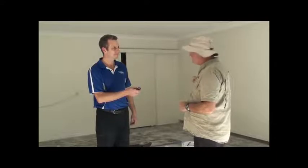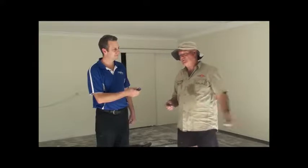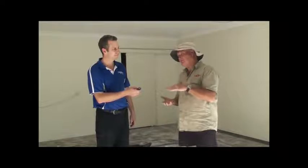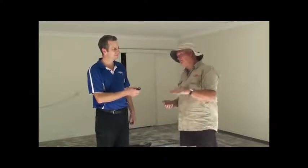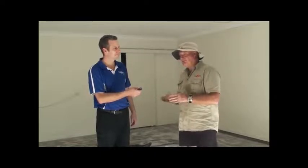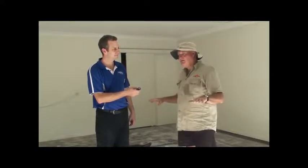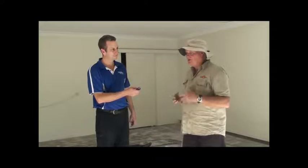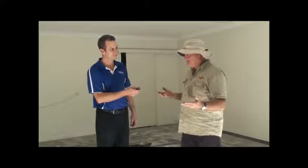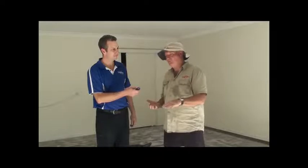The other thing that I'm watching out for is once I've cut around the outside, the exterior perimeter of the garage is where it tends to bleed in, and if you don't put enough on, it becomes dry and the flake won't stick. So the whole key of what we're trying to do here is to get an even coat of epoxy across the whole floor, and of enough volume that the flakes will bond into that epoxy, and at the same time absorb into areas that may be a little more porous than others.